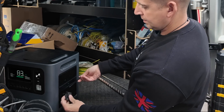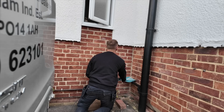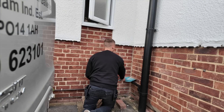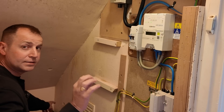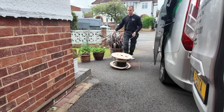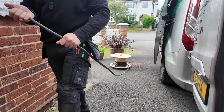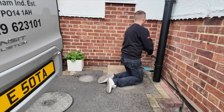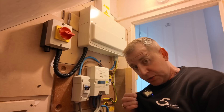So why am I using a mains power drill? We'll touch on this a little bit later in the video. Hold on — this is that moment where you need to double check exactly where you are drilling. If I can, I always like to drill into the building rather than outside to prevent any brickwork from getting blown. I also always start with a pilot 10mm bit, start it on hammer, then finish on normal drill mode, which prevents you from blowing anything inside or outside.